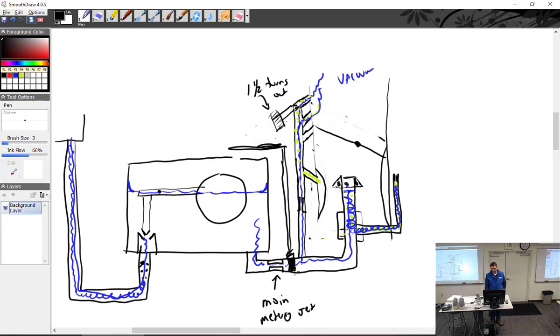Now, when it blocks off all of the fuel, we call that idle cutoff, but it works all the time. In fact, I was flying this weekend. I think I made my son poop his pants because he was just staring out the window and I'm screwing around with the mixture and I pulled it back too far and killed the engine in flight. I just push it back in, and it starts right back up. So it'll kill the airplane at any RPM. We call it idle cutoff because that's where we pull it.